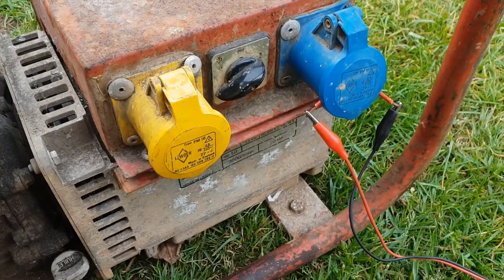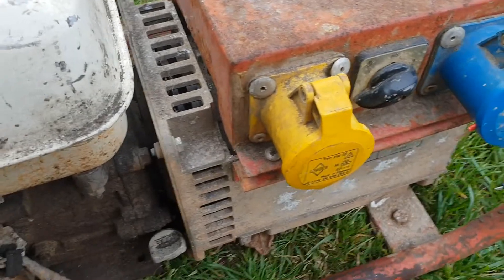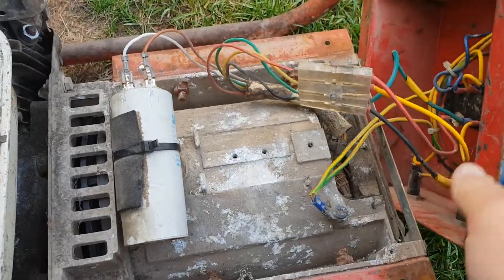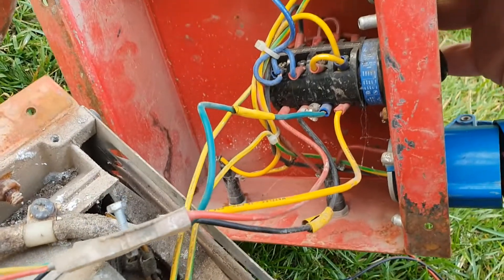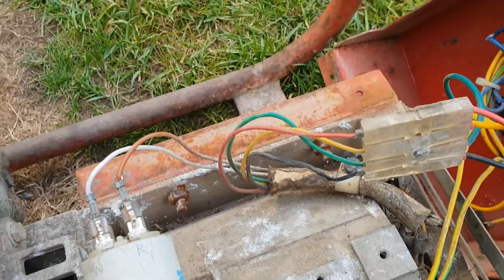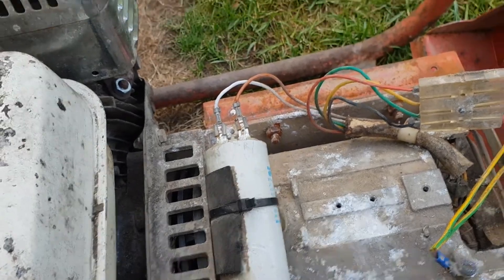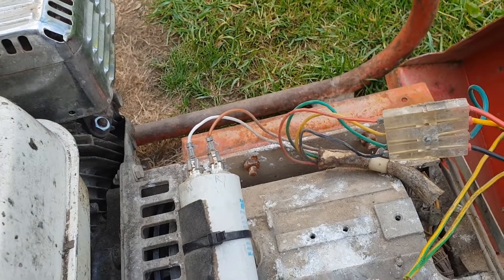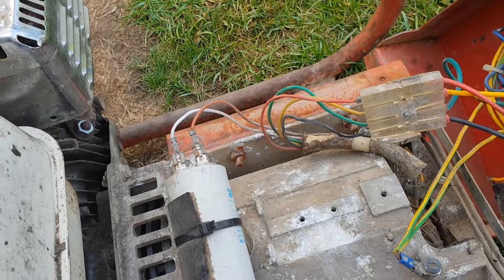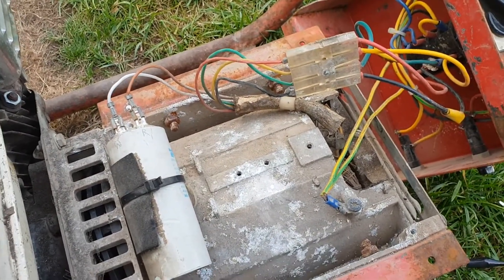To fix these, most problems come down to a couple of things — the obvious one is loose wires. I've unbolted the cover and inside you can see there's a big barrel switch with various outputs, four wires taken off the generator feeding down into the coils, and this big device here which is the capacitor. The way it works: you have two coils of wire — one produces a magnetic field, and spinning inside another coil induces a larger voltage which causes current to flow and produces the output.